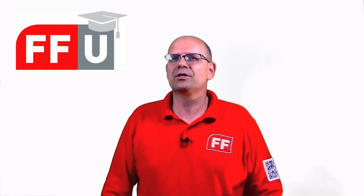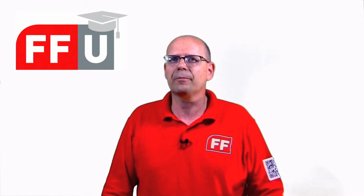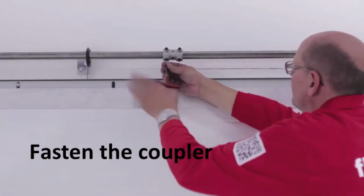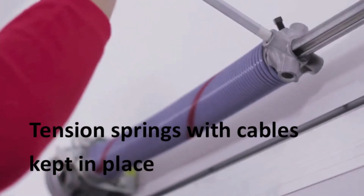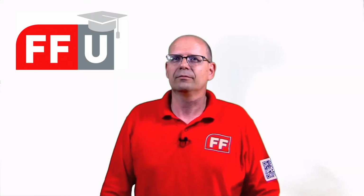Do the same at the opposite side. You now have both cables secured and a bit of tension on each spring. Now fasten the coupler and you can tension each spring one by one, with the other spring keeping the steel cables in place. That sounds a lot easier.